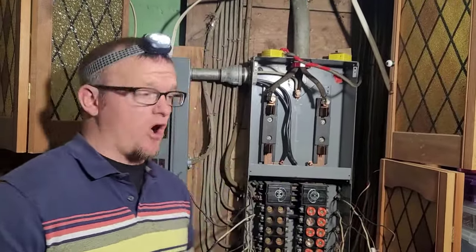Now we're ready for the next step. I've got both panels removed with a lot of wires. Typically I won't use the lower sides, but my wires are already stapled nice and neat and plenty long enough, so I'm going to use those sides. I've knocked out the top holes that I need — you can count your wires and knock out the appropriate holes. You take a flat head, push right through, then use pliers to twist them back and forth until they pop off. Then use the appropriate Romex connectors to get your wires in the box.